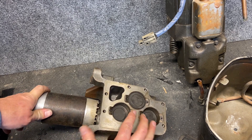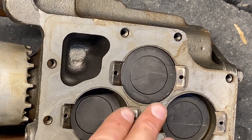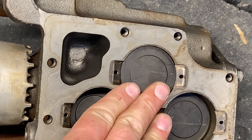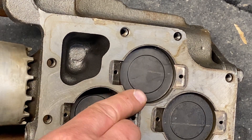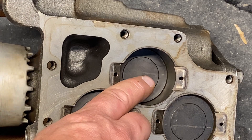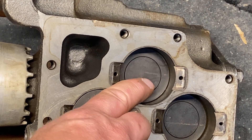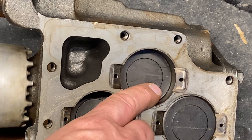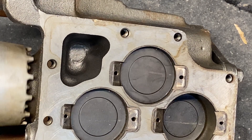These compressors are the oldest style we've used. There is one drawback: looking at just this piston, when it's at top dead center and coming up to a compression cycle, as it goes back down, all that gas we spent time compressing is now expanding back — so there's energy loss right there. Once we get to a certain point, the suction valve opens and sucks in low pressure vapor. Then at the bottom side, we lose efficiency again before we come back up and start compressing. Every time it's changing direction, we're having an efficiency loss. That's one of the things that makes these compressors very stout and easy to understand, but the overall efficiency is fairly low because of that.